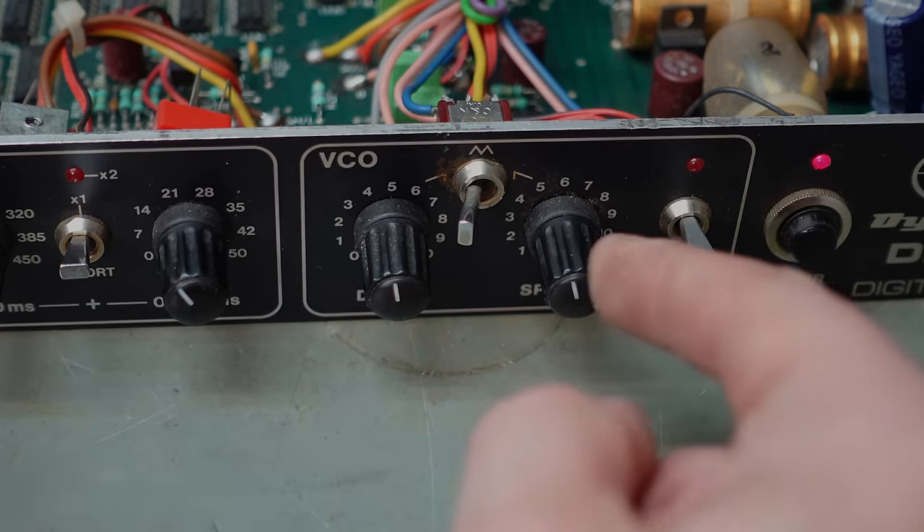I'm surprised - how has that happened? The wires need to come off anyway. And to make matters worse, this is a 100k positive log and this one is a 100k negative log with small shafts. Having just realised what a horrible proposition that is to replace, I've managed to push the negative log pot back together. I'll put it in the ultrasonic cleaner with the others and then give it a glue-up.